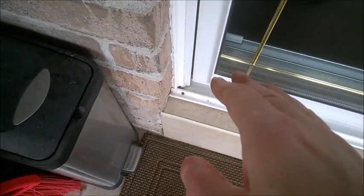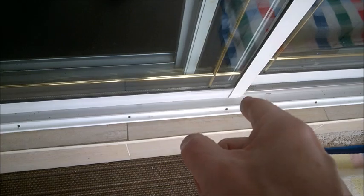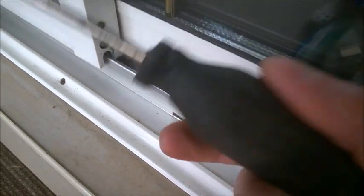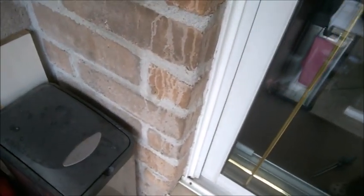At this point it's about two to three millimeters at the bottom and the top looks flush. I tried to lift it there but it doesn't appear to align perfectly, so what I'm going to try is to lower it at that end — basically tilting it a little bit like this. It's trial and error. I'm lowering it, turning it counterclockwise with a hand screwdriver. Let's try one full turn and see what happens. Move the door a little bit to position and seat the wheels.